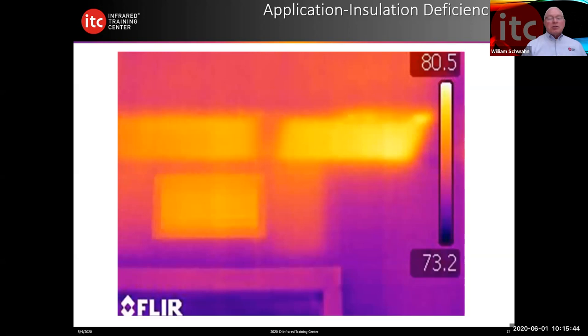Here's another interesting image — an insulation deficiency at a ceiling. It's much cooler on the inside than in the attic. The insulation deficiencies show up as warmer because we're detecting actual heat from the attic. The second law of thermodynamics tells us heat transfer always occurs hot to cold. So that heat energy moves through the ceiling so the infrared camera can detect the emitted radiation from the lack of insulation in the attic.